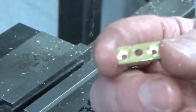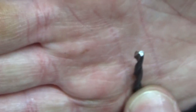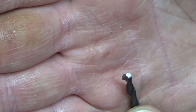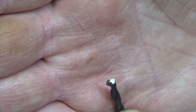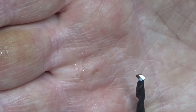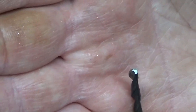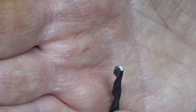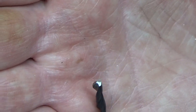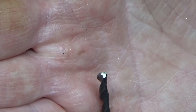The key to successful brass drill grinding: do not forget, when you're finished, to go back and re-grind the drill before you put it back in your box — otherwise next time you pull it out to drill steel it won't cut very well at all. I'll just pop that back on the grinder and clean it back up to get rid of those stoned edges.